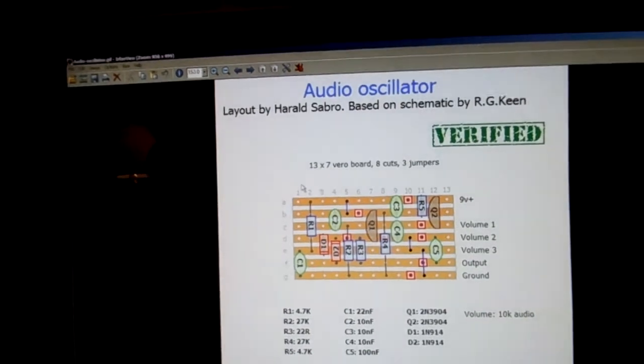But yeah, this was a fun little project. And apart from one issue, it didn't fire up. There was a ball of solder in between 2 of the rows, and I had shut my iron station off, so I turned it on. And I kept picking at it. Once I got that cleared out of there, beep, we were in heaven. And I tried, like I said, I changed the value of R5. I tried swapping it out.